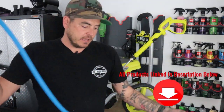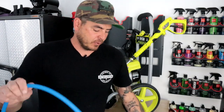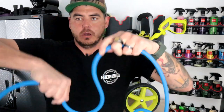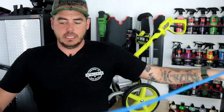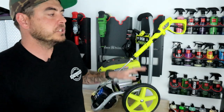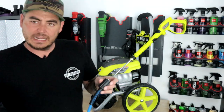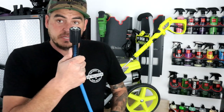Here is the hose I recommend — the Uberflex hose. FlexZilla is a separate brand but uses the same patent and construction quality. It's super pliable, doesn't kink, and has no memory in the line. The good thing is the connection point is M22 by 14 millimeter, which is exactly what this pressure washer uses. You don't need any adapters — you can literally just screw it in and you're good to go. You can add quick connects if you like, but it's a direct replacement.